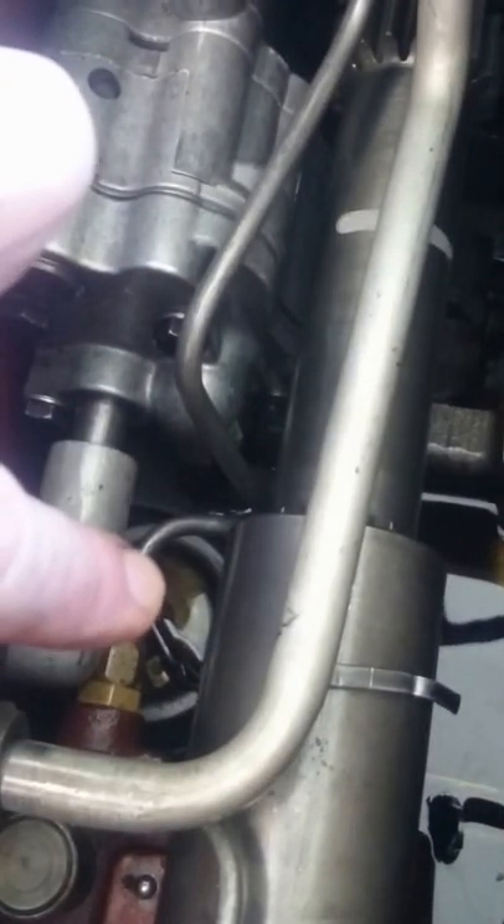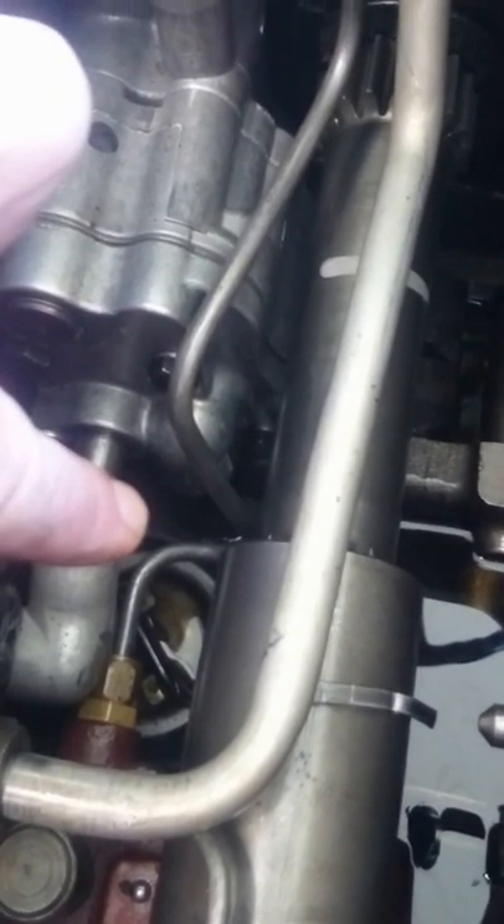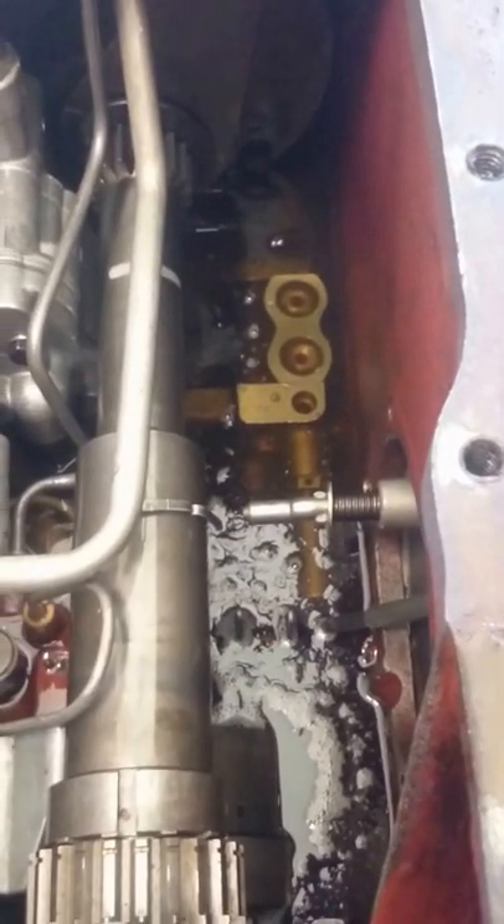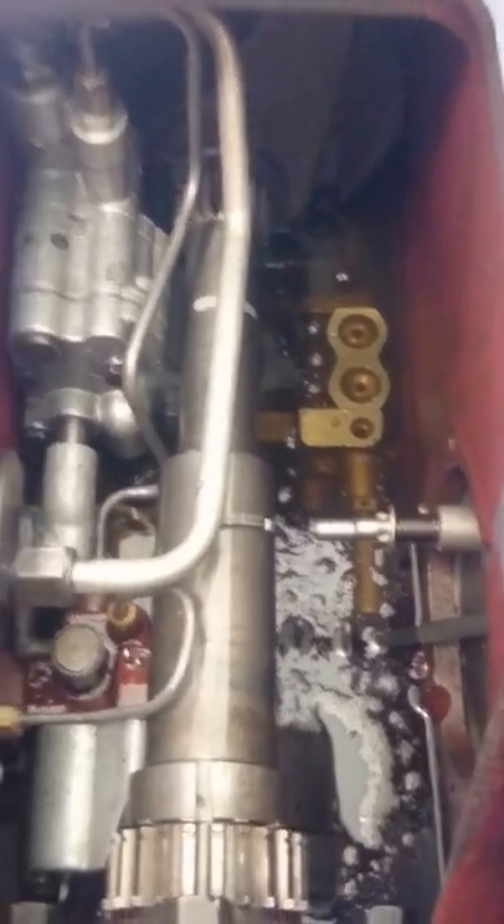We cleaned off and put a new filter in for the main hydraulic pump, and cleaned off the filter for the auxiliary pump. Here I'm showing the dipstick right here — after running it once, our oil level is way down. We put some more oil in, ran it, and the oil is now registering on the stick. We're going to get a shooting of oil out of the main pump, so I'll have to block that and check what the pressure says on our auxiliary gauge.